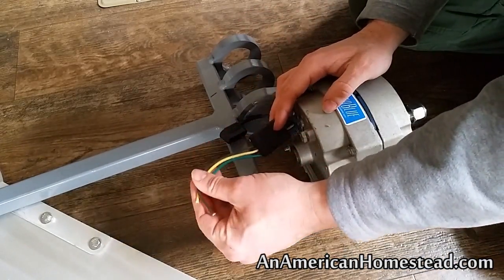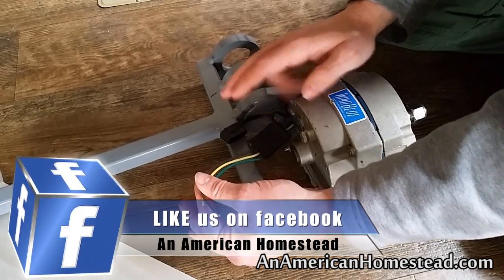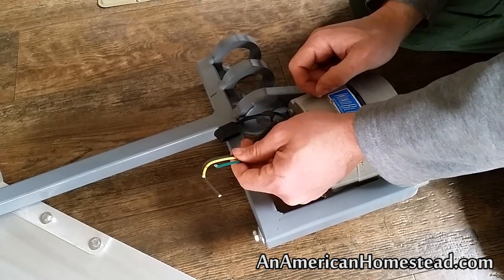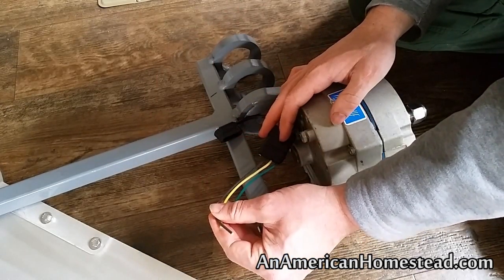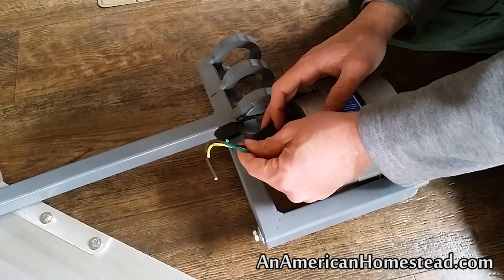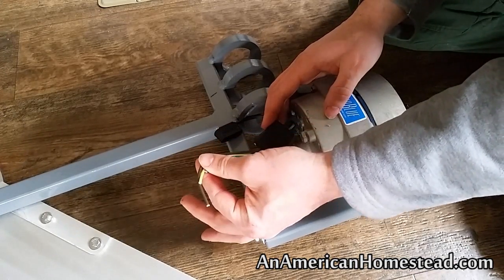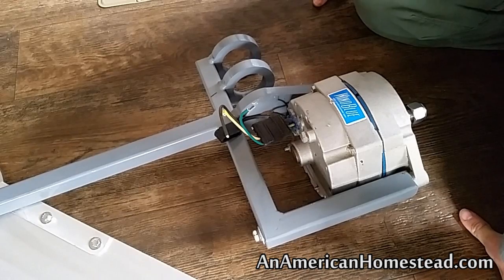As it's configured right now, it's ready for AC power — three-phase AC power. This is how we're going to run it. Unlike the Primus wind turbine, which is configured only for DC output, this is a lot cheaper to wire. We have basically an extension cord — three wires — that run down the tower, much cheaper than eight-gauge DC wire. The three-phase wire runs all the way down to the battery bank, hits a rectifier, and that rectifier transfers the three-phase AC power back to DC power, and then from there we go right to the battery bank.